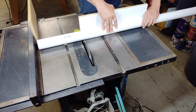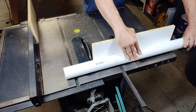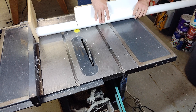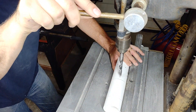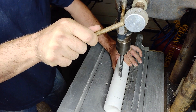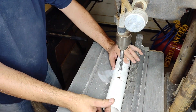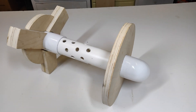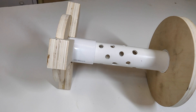Now this is where the real innovation is in this design. The outflow pipe extends all the way from the outflow support to the baffle at the bottom of the separator bucket. Along the entire exposed face of the outflow pipe, half inch holes are drilled — 32 holes in total. This provides twice the area of a section of the outflow pipe and halves the pressure at each of those drilled holes. Because the holes are facing in various directions, it disperses the airflow into the outflow pipe. In this dry fit there are only 20 holes; I go back later and add the additional 12.